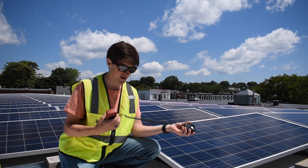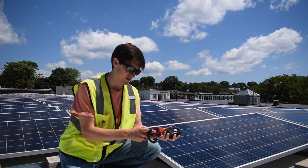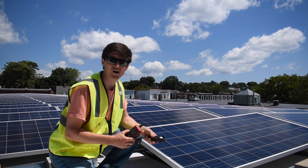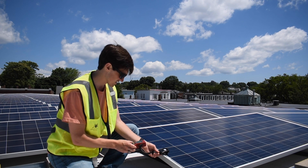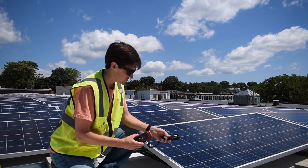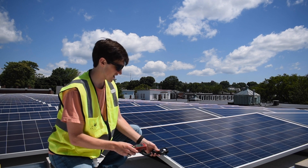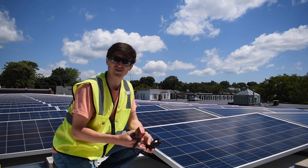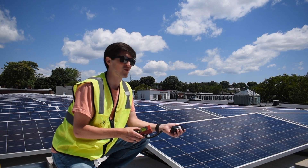This one's pretty nice — it's got an external sensor. We'll turn it on here and set it in watts per meter squared. We're reading about a thousand today, but what's important is actually the angle. We have our solar modules here, and we want to make sure that the angle of the Amp Probe is aligned with the plane of the solar modules. If the solar modules were pointing away from the sun, that would give poor irradiance readings — that's why the angle matters. Today is a beautiful day; we have about a thousand watts per meter squared. Even if you can't get close to the site and you're flying from outside, just emulate that angle of the solar modules and that'll give you a good sense of what your irradiance is for the day.